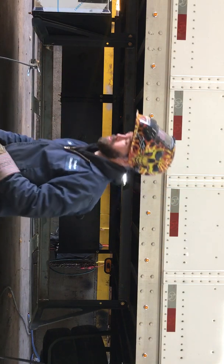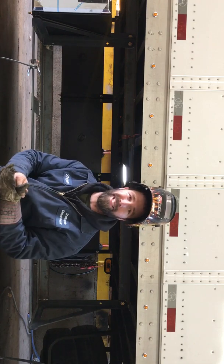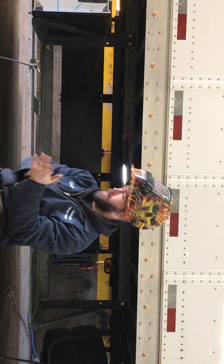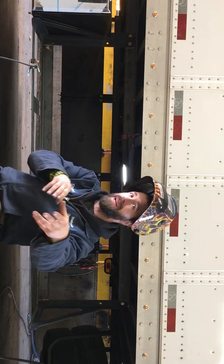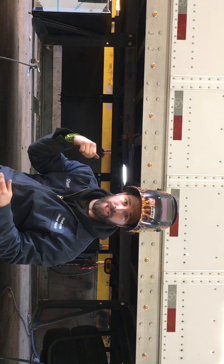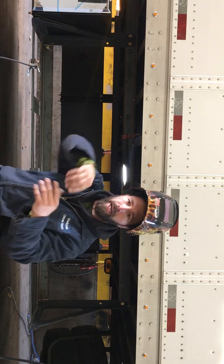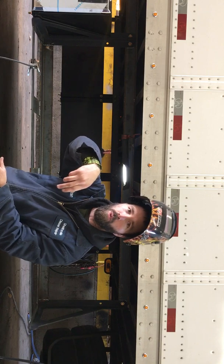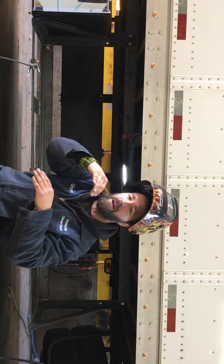Yes, that is one of my rhythms right there. When I lay a weld bead, and most people are gonna tell you this is probably the easiest one, you lay your C and you can start either way, however you wanna do. It's gonna depend on angles and everything that you're working with, whether you're on top, whether you gotta do a shitty angle like me, or whether you gotta do vertical beads. Either way, you make your C's whichever way. I like to try to walk away from my puddle that I'm laying my beads so I don't pile it up any longer than it's got to.